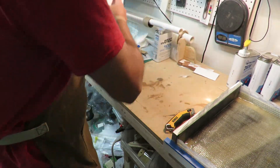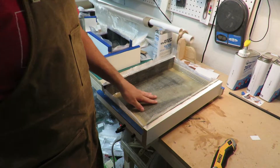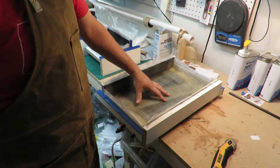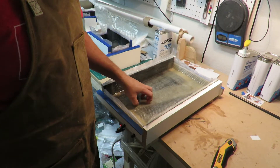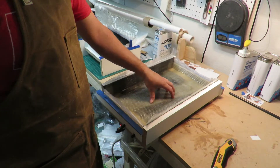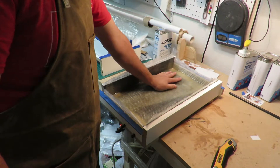And one problem I'm going to have, I'll show you now. Here's the stab mold — it's cured out and it's got a lot of glass on it. This has got some of that 20 ounce cloth that I put down. And I put here in the center section about maybe five or six layers, just right here in the center section of that cloth. The reason I did that was, in my excitement of getting these things molded, I forgot to put my dots.